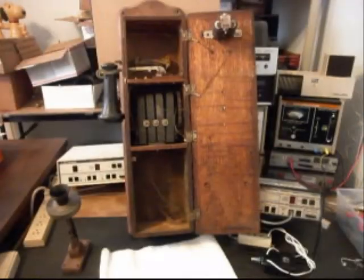We'll also be marking where Tim needs to connect his battery lines to use this telephone as an intercom telephone. And we want to mark the connections that are going to be for his bells and his magneto, because there'll be separate connections for the magneto and the bells, and a separate connection for the battery line.